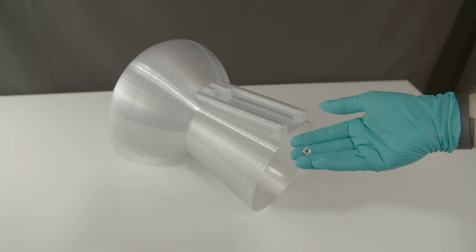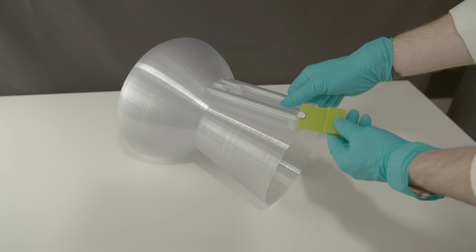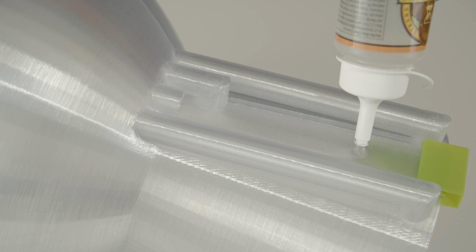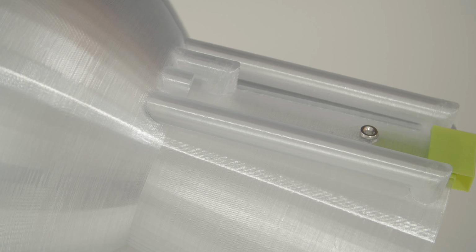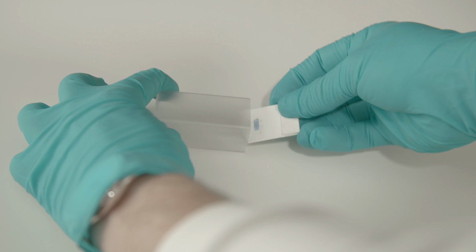24 hours or so later, once the epoxy is cured, it's time to attach the magnets. I use Gorilla Glue or fast drying epoxy for this. I 3D printed a tool to get the magnet in the exact place every single time, but it is roughly 45mm off the top, and same procedure for the electronics box, but it's 25mm off the top.